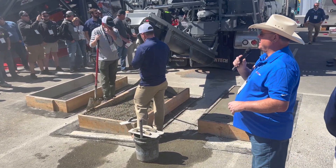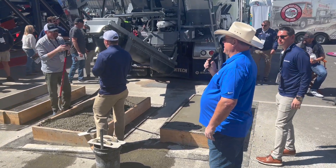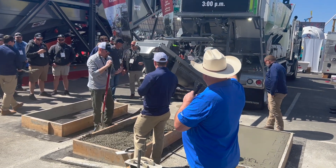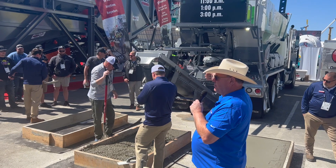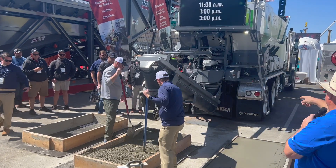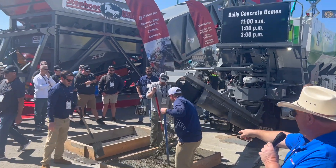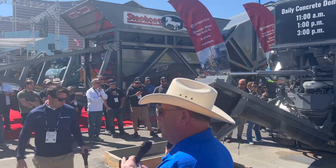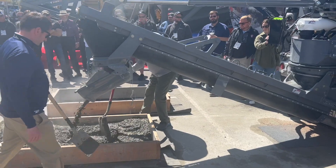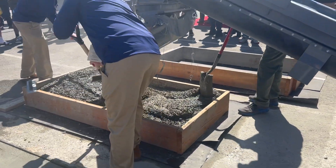Rob's coming around with some concrete in his shovel. What I mostly want you to see is that as our truck produces concrete, all our material is segregated and dry. It drops into the bottom of our mix area, and in nine feet, ten seconds, it is completely mixed and evenly distributed. All our rock is coated with this powder, making the best use of this powder that you can.